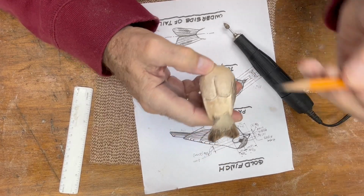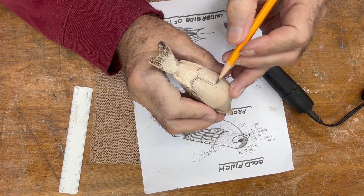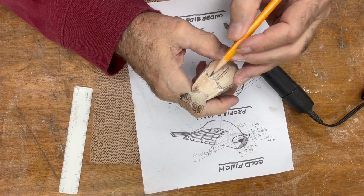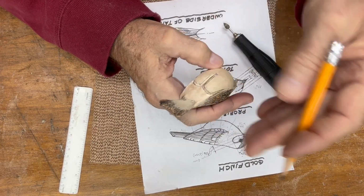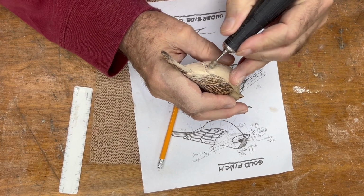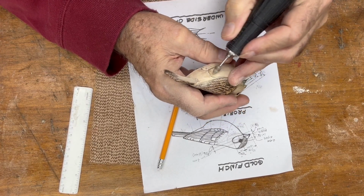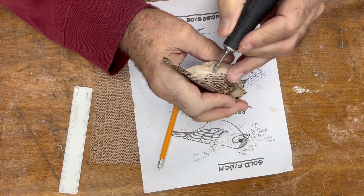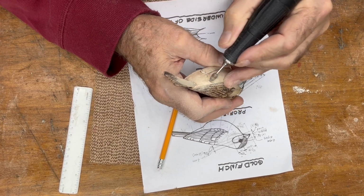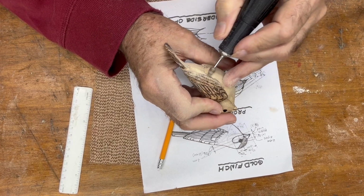So here's what we have now. We have the channel edge that's still existing here. Comes up here. We want shallow up to this X. We have this, and this, and this. I'm going to roll this like this. I'm going to come in here. I'm going to round that over. And if you notice, I put a pencil line in down in that valley so that once I get like this chamfer down and start seeing the pencil line disappearing, then that tells me the angle is meeting that pencil line and I should be in good shape.